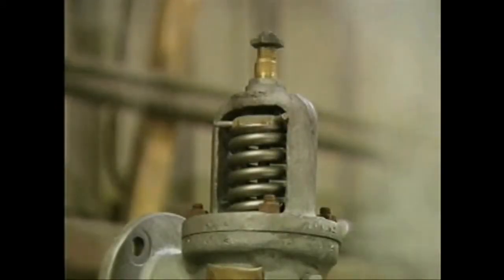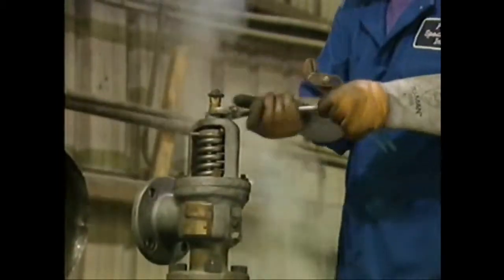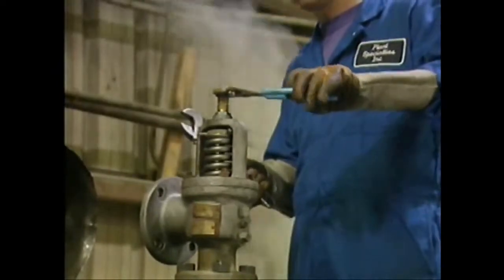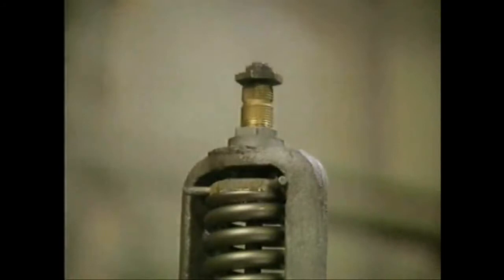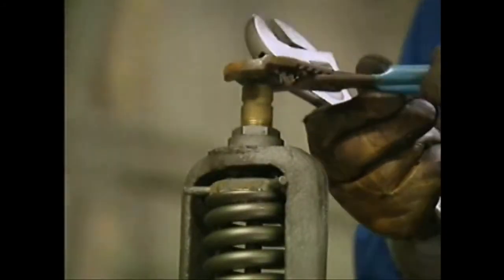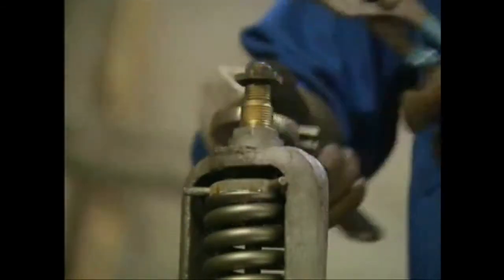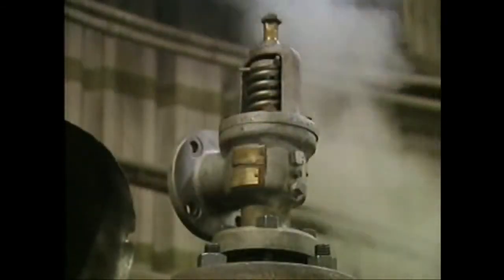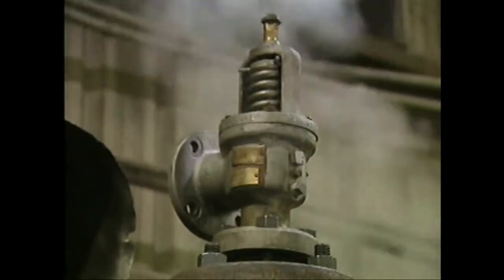For this huddling chamber safety valve, you make set point adjustments by turning the compression screw. Before doing so, you must lower the pressure so there's no chance of the valve opening accidentally, and you must break the lock nut free — trying to turn the compression screw without loosening the lock nut will probably damage the screw. If the valve is opening too soon, tighten the compression screw by turning it clockwise to increase tension on the spring. If the valve is opening too late, back the screw off by turning it counterclockwise to relieve tension. After adjusting, test the valve again. Usually, several adjustments and tests are needed to fine-tune the set point.